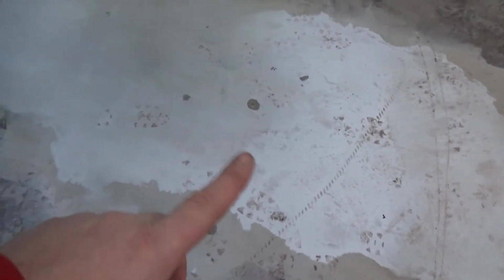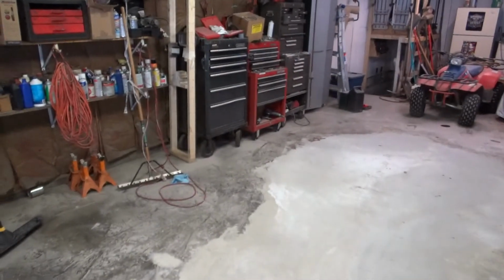Alright, I might have fibbed a little bit. I didn't actually end up doing anything yesterday. The big thing is, I'd rather have bumps in the concrete than ruin my concrete. So I gave it another 24 hours. This is what we got. It seems a lot firmer than the days prior. I'm going to sand these edges a little bit by hand and see where that gets me, and then maybe sand a little bit in the center by hand, and if that's going good, then maybe I'll break out the power tools, but not before that.